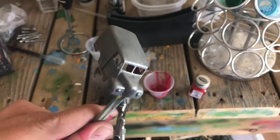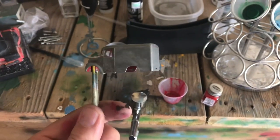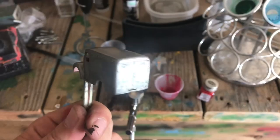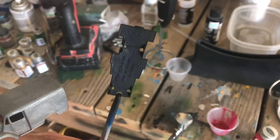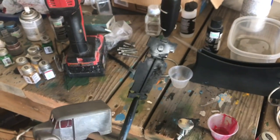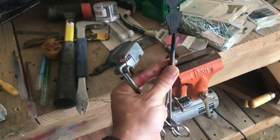I've gone ahead and removed all of the original paint from the casting — it really didn't take much. I did a quick light spray with my citrus strip paint stripper. Here you can see the base; I've already gone ahead with a coat of my flat black. It's just a standard Tester's flat black paint. I've painted both sides of the base so that I have the option to use either one in the assembly.